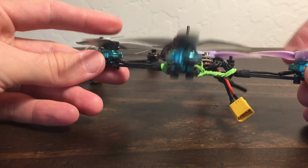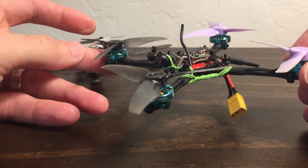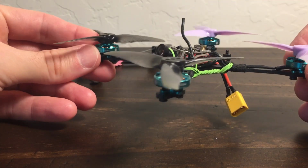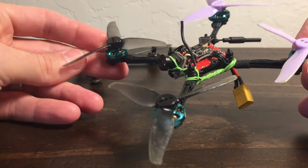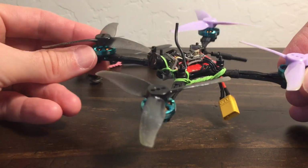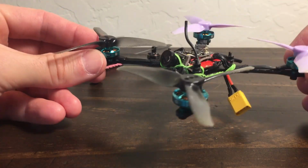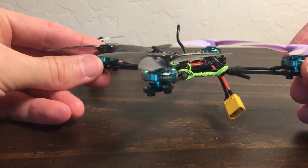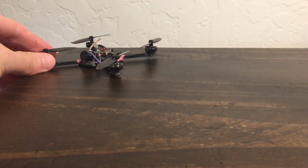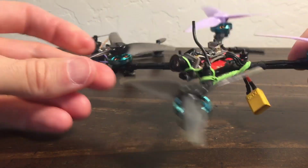One of the issues with going up to 48 kilohertz is that you lose some of that braking strength. That braking, that damping, is what gets rid of the floatiness. So if you've got a prop with a lot of inertia, or kind of an under-prop or over-prop setup like this, borderline, then you lose some of the control. So with this, there are some pros and cons, and they're more balanced. On the other one, the pros just outweigh it. Just go do it. This one, I don't know.